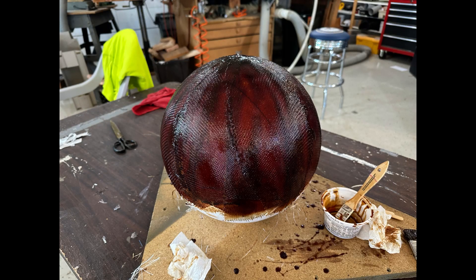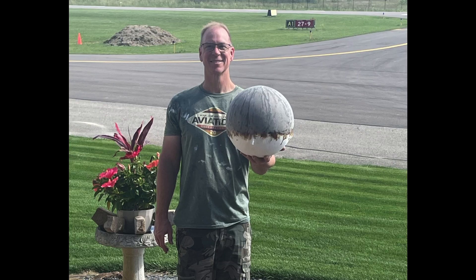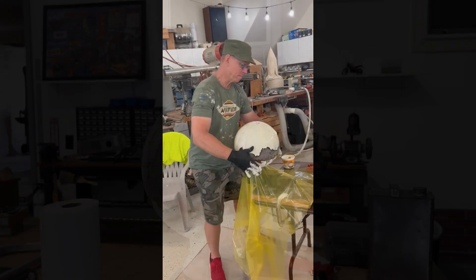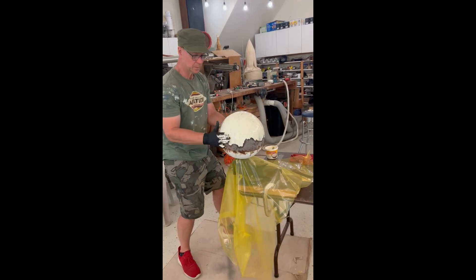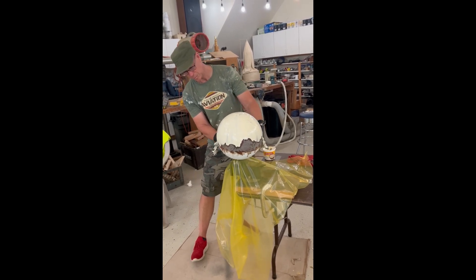After three layers of glass, this is what it looked like. Normally I'd put peel ply on top, which lets it cure with a fairly smooth surface, but there's no way to get peel ply around a ball, so it ended up with a very rough surface. After many hours of sanding, this is what it looked like. I brought it back to Len's house for the next step. The next step is putting on what I call 'peanut butter' — it's basically resin mixed with a different hardener, a little softer and easier to sand.